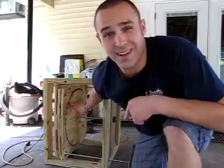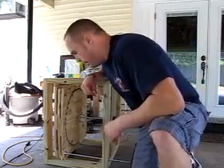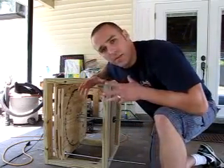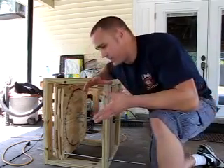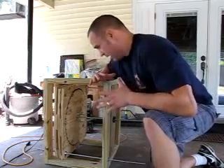Every 10 degrees, 36 magnets in each wheel, 36 magnets in each stator, and I slapped three of them together and offset them. I don't know exactly what degrees I offset them — I just staggered them so that they were staggered evenly.